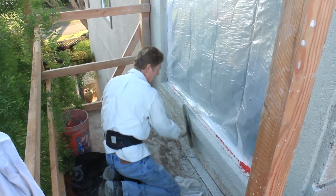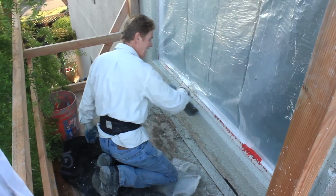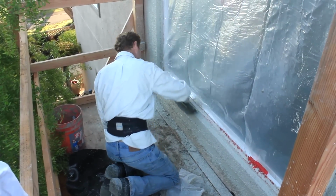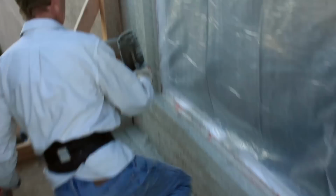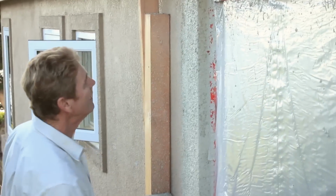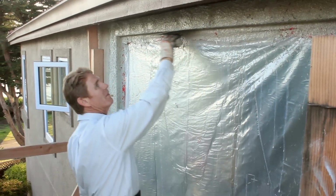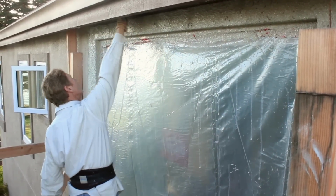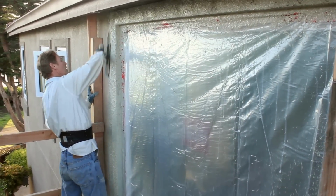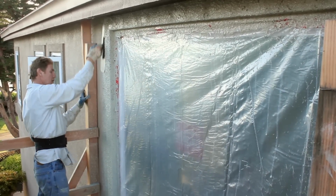All right. Anybody know what kind of sand we're using here? The grit? Anybody care? This is what we call in the trades a 1620. 1620 is the heaviest finish available. That just means it's got fat sand. Santa Barbara is like silica sand, very fine. Then there's 2030, which is the medium, and that is real close to this. It's tough for the average person to tell it apart, but of course we're professionals, we can tell it apart.